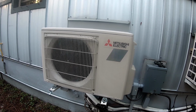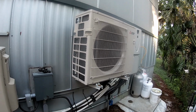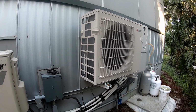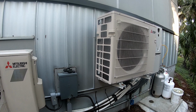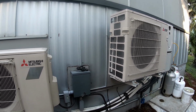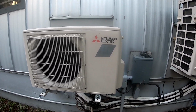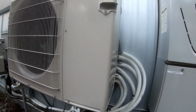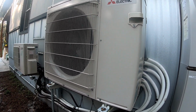In fact, we've had to rely on that part of the summer when this one started crapping out. We noticed the evaporators were getting a light ice-up on them, as if they were getting low on charge after about 6 or 8 months. Getting a small ice-up on the evaporator, like a low charge. This one, no problems at all. After topping off, this one went right back to working fine, no ice problems, no issues.